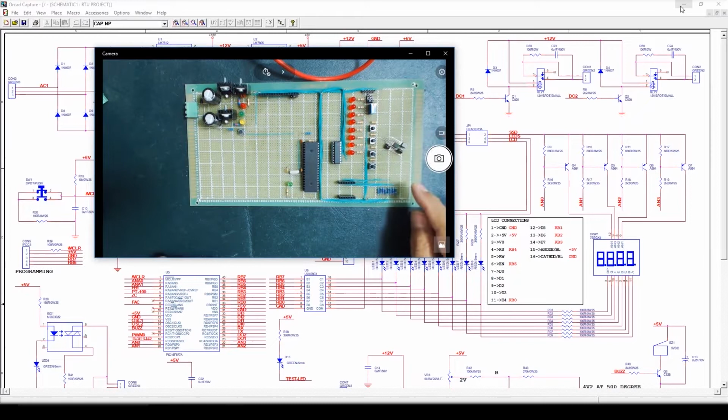Here we have 4 transistors A564. We have 4 resistors of 680 ohm. And we have 4 resistors of 2.2K. Now we'll develop a circuit to select the anode of this multiplex 7-segment display.